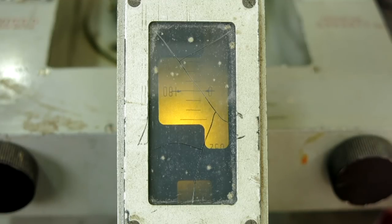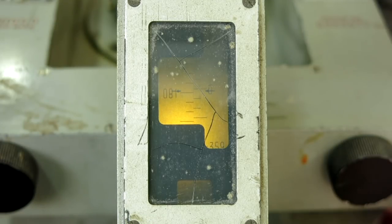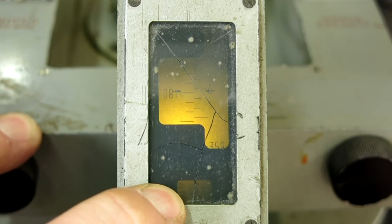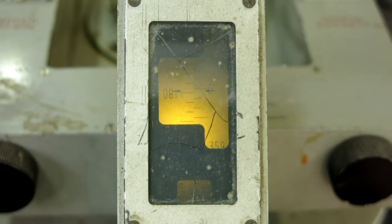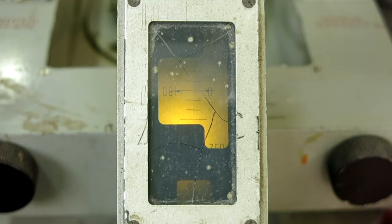You can index between each hash mark here. What's interesting is it's shifting the optical path, and here the tiniest ticks in there — they're hard to see — are seconds. You might say: you just make the move on the optical part, then actually move the rotary table. But I would disagree that these tiny hash marks — they're too fine, you can't detect that kind of movement — is my argument. Maybe that's how it works and you just have to have really good eyes, which I don't. Anyway, I'm looking for information on these things. If anybody has an old manual kicking around or manages to track one down on the web, I'd really appreciate getting pointed at that.